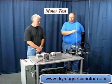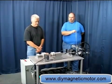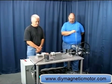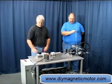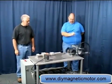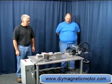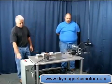We're using the original method for determining horsepower: horsepower equals 33,000 foot-pounds of work done in one minute. It came about by an average horse being able to lift 330 pounds, 100 feet in one minute. We'll be converting that horsepower into watts, with 746 watts being the equivalent of one horsepower. The weight being lifted is 22 pounds, rising 3.267 inches per revolution. We'll convert that into foot-pounds, foot-pounds into horsepower, and horsepower into watts — that will be the motor's output power — then compare that to the input to the coil.